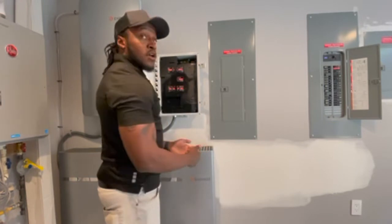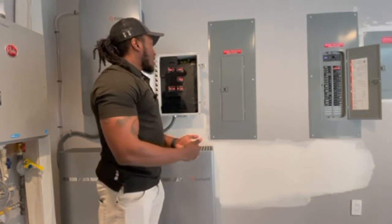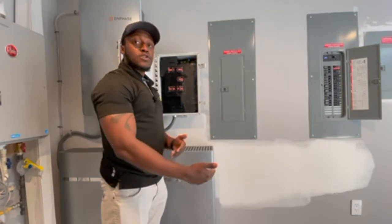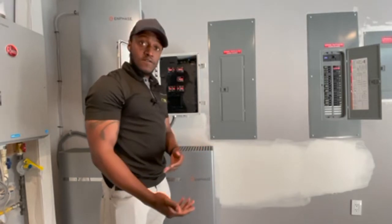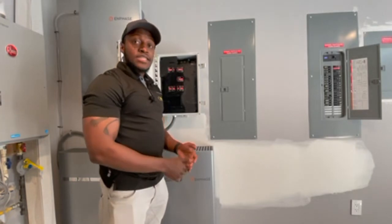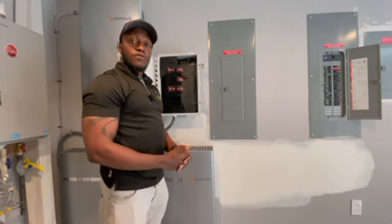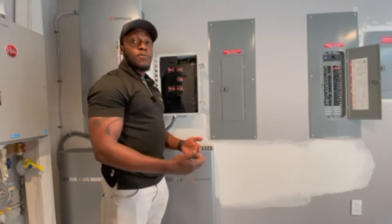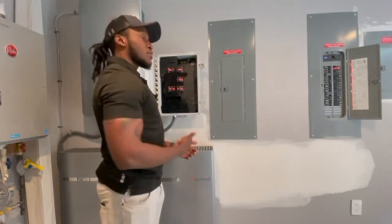The cloud light with the up arrow is your Wi-Fi light. It should be off, and that's what we're troubleshooting right now. The next light is a phone with an arrow inside of it — that is the AP mode, and the button corresponding to it is how you turn that on and off. With a simple press, you'll see that light turn on; if you press it again, it should be off. Next, you'll see a lightning bolt — that's just your power production light. To the right of that is also the signal between the combiners and all the microinverters on the roof. Keep in mind those two lights might go between green and red, but don't worry about them. We're just going to continue focusing on the first two lights that we already discussed.